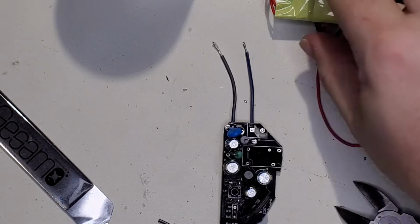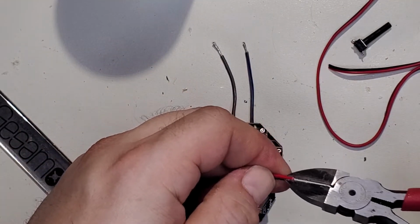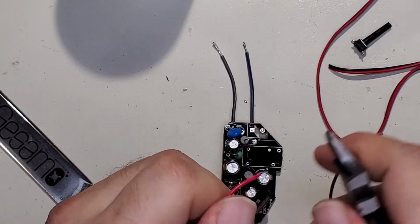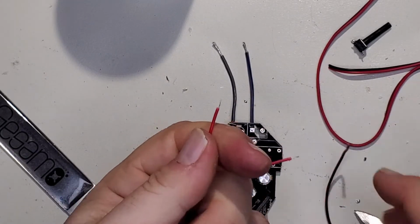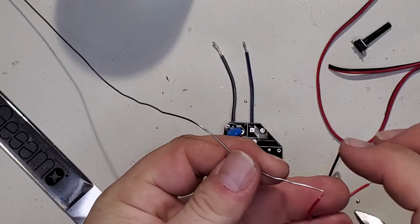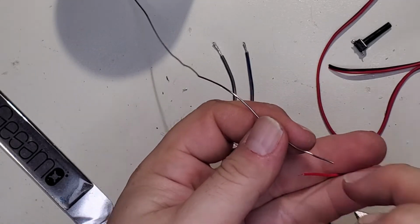All right, now let's do some wires to the relay. The relay's not going to go very far. Now this is just feeding the coil. You know what? I'm just going to do that because it'll happen anyway. This is small wire. It's very thin, but it's only for the coil. So that'll be fine for it.